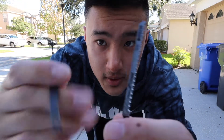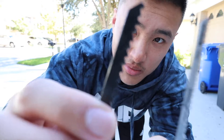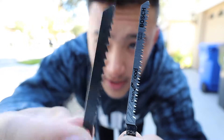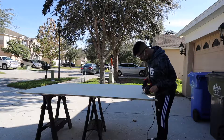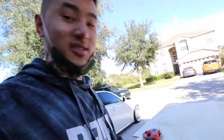So you can see the difference between the blades. See the black one? I was using the black one. Now I just bought this one — the teeth are a lot finer. This is what I just had in the bag with the jigsaw, and this is what I just bought. With this new blade it makes a big difference — I can actually cut angles and stuff. It's smaller and it's finer. But I wasn't paying attention; I was trying to get it done last night. Big difference in the cutting. Make sure you use the right blade.